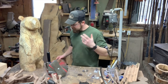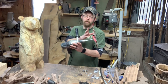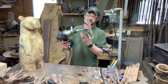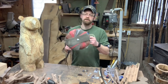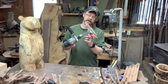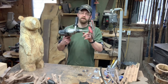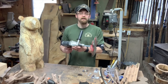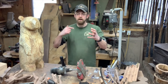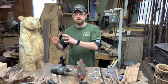I've gotten into making my own flap sander fully. What that entails is having a shaft, a way to tighten down the sandpaper, and several pieces of cloth-back sandpaper. I took a half-inch bolt about six inches long. Don't use a carriage bolt like I did — it makes it really tough to tighten. Just use a regular headed bolt you can put a wrench on. Get a nut to fit and two washers — put a washer on, put all your sandpaper on, then another washer and the nut.